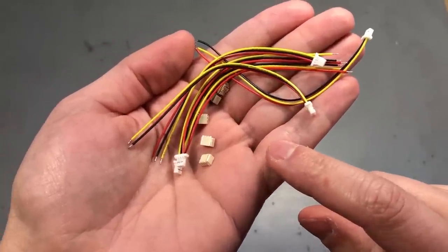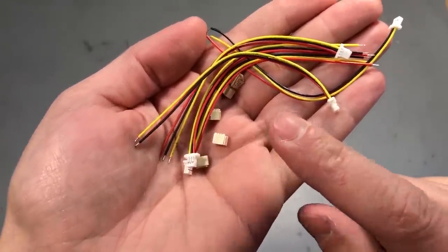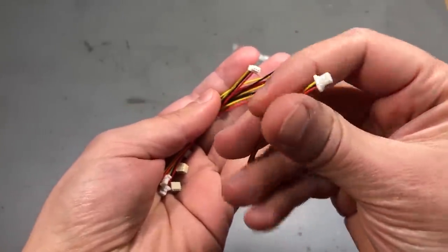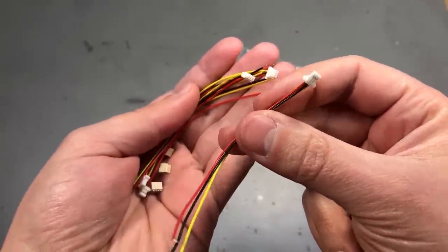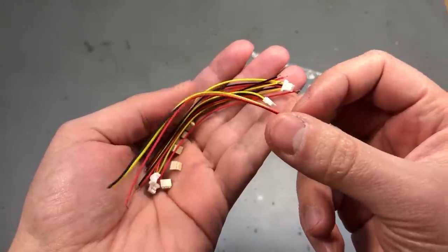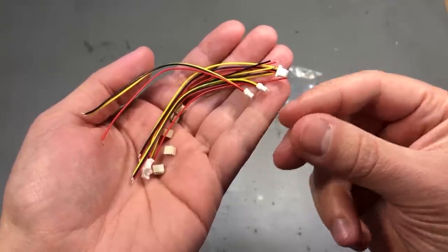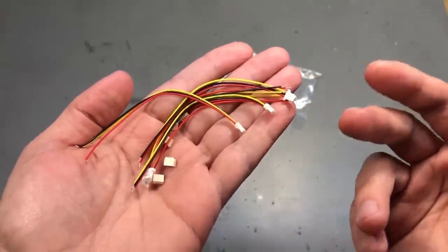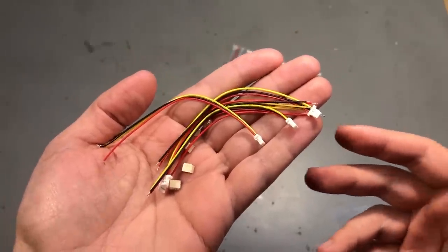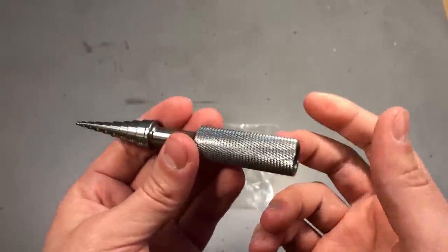Next I have a set of 5 pieces — JST 3-pin male with wires and female SMD connectors. These are JST SH, 1.0mm pitch, and the wires are 28 AWG. I needed the female connectors with wires to interface with a connector on a flight controller board — I want to add digital RGB LEDs on one of my RC planes. This connector makes it easy to connect without soldering and gives me the option to disconnect the LEDs if needed. These days fewer people are designing boards with classical 0.1-inch headers; as boards get smaller, people use smaller-pitched connectors to save space.